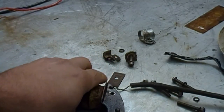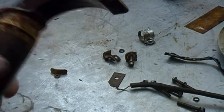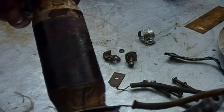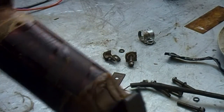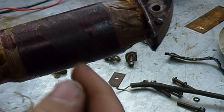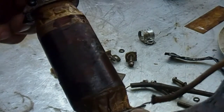Those are all places where the enamel on the wire has broken down and exposed just the bare copper, and corrosion has started to form. You can't be having any of that — shorts, open. Even before the coil went completely open, it might have been shorting between a length of winding — that's 40 turns of wire — which is going to decrease your total overall length and decrease your spark voltage.